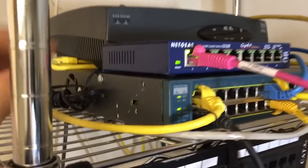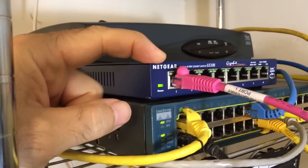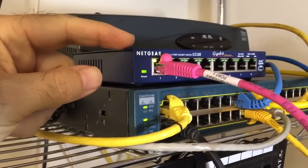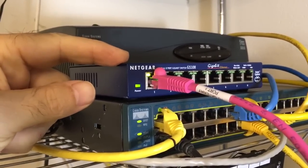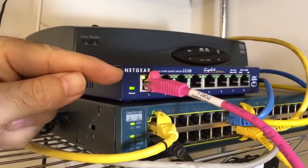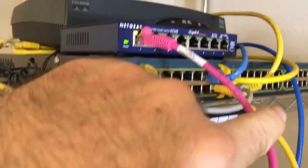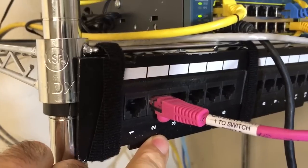For simplicity's sake, I'll tell you right now it's plugged into this pink patch cord. That outlet that was unidentified is port 2 on the patch panel, which is plugged into switch port number 1 on this Netgear. You can't use the toner, so once you get this beacon going — this on-off of the link light — you come back, look at the switches, and stare at them for a while. You'll begin to see one link light that keeps coming on and off in a rhythmic fashion. Once you've figured out which one, follow the patch cord back to the patch panel location, and that's your jack number — that's your outlet.